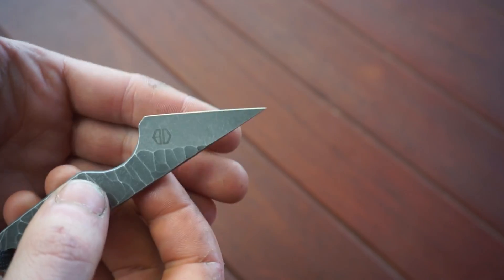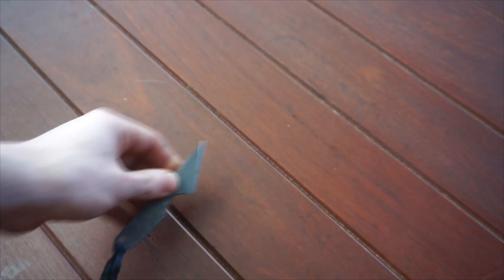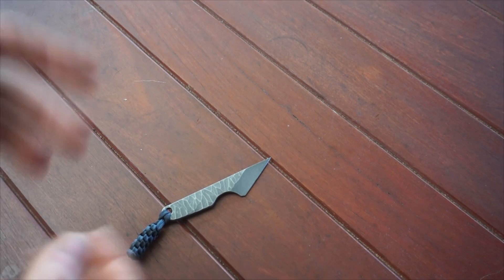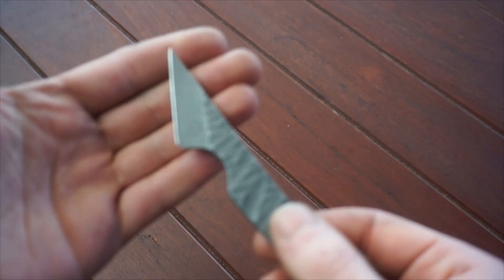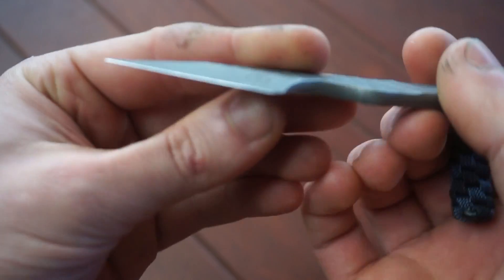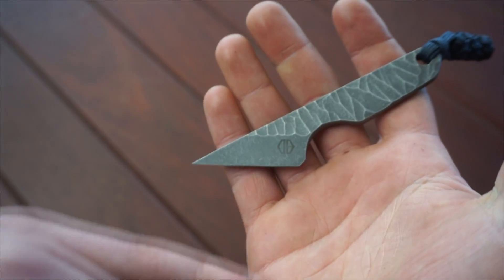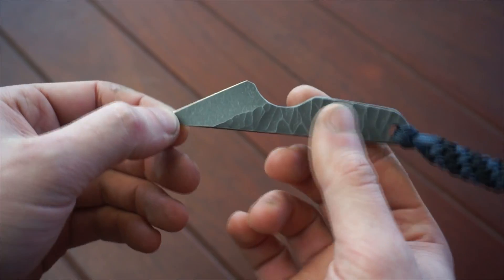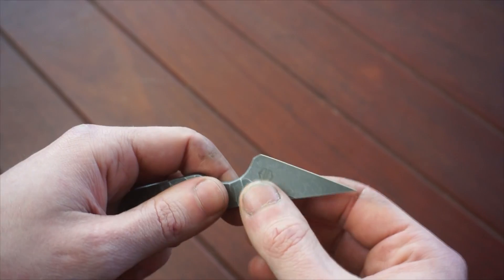I'm very happy with how straight I got this edge. I actually tried sharpening this on the disc grinder and that worked fairly well. The reason I went with the disc grinder is that a disc grinder doesn't wash out like a belt grinder does - a belt grinder, the belt can sort of pucker up around an edge and convex it, and it can also wash out crisp lines. The disc grinder doesn't do that. It also takes a heck of a long time, but it doesn't do that - that's why I went with it, and it works no problem. It's just crazy sharp. We've got an angled logo on this, which is something I'm really liking. I think I'm going to have to do this standard on all of my Kiridashi-style shapes with an upswept blade like this, because it just works better. So yeah, this is gonna go out for leather - the guy who ordered it is in Washington - and then I'm gonna send it out to him, probably in a week or two.